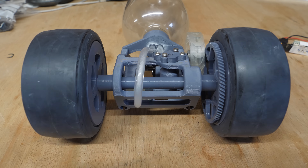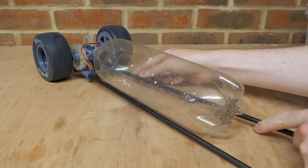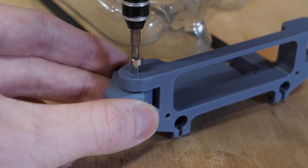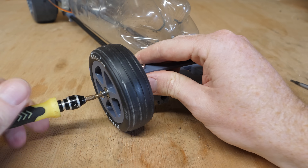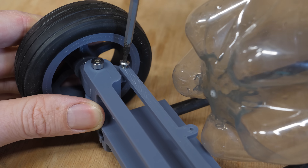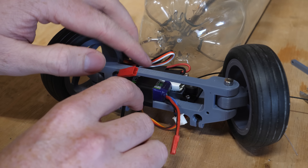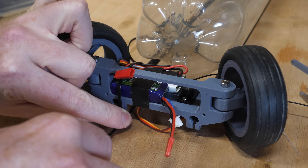It's time to build the front end of the chassis. To keep the weight low, I decided to use two carbon fibre spars to mount the front chassis, with the bottle sitting on top of the spars nicely. Once the front chassis is clamped in position, it's time to attach the steering and some slightly smaller wheels. These wheels would probably have enough grip to be the rear wheels too, but those dragster tyres weren't cheap, so I'm sticking with it. Both front steering pivots are joined with a steering bar to correct the necessary steering geometry. And last but not least, some messy electronics mounting — which I'm not proud of, but this is a prototype, so why make it neat?